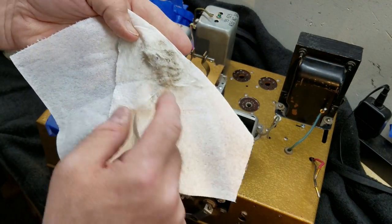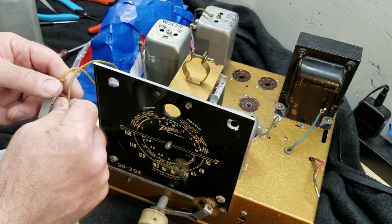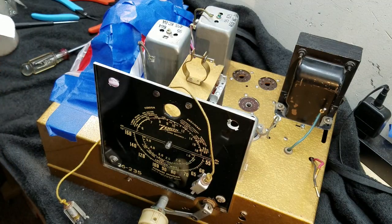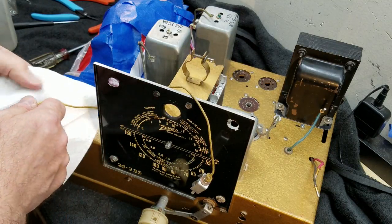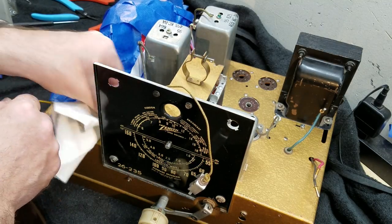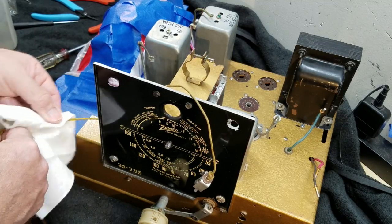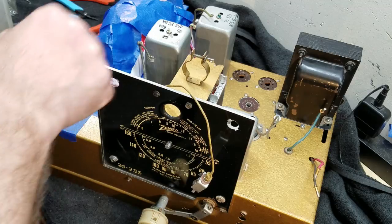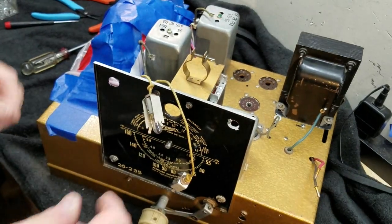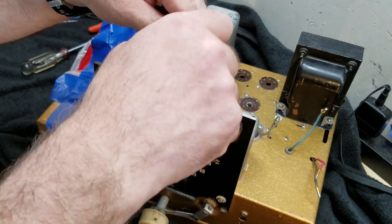That's all I took off the wire — it's not a lot, but it's enough to brighten it up so when I put this back together it'll look better. Until the lacquer thinner dries, the wire insulation will look a little dark, but once it dries it will be bright, and then I'll put the lacquer on it. The paper towel will have left little fuzzies on there, so go ahead and brush those off with your fingers.